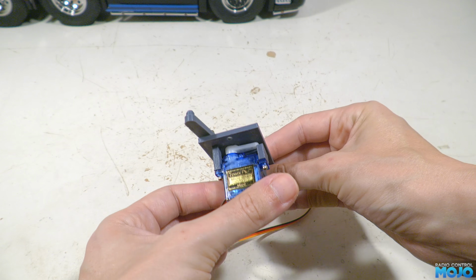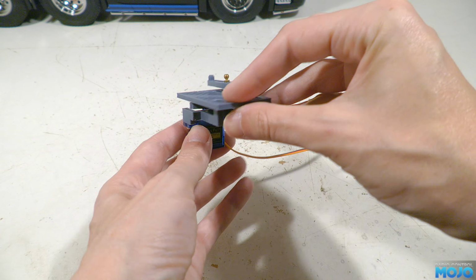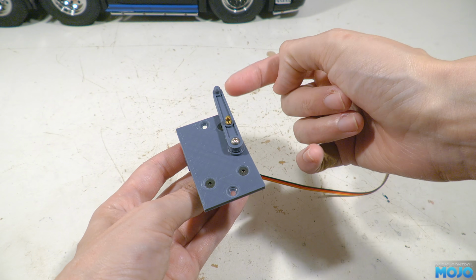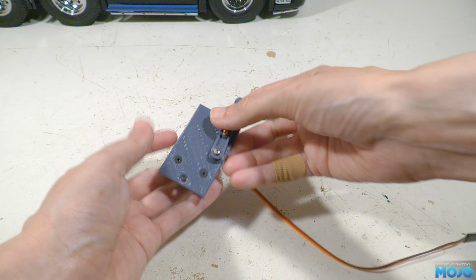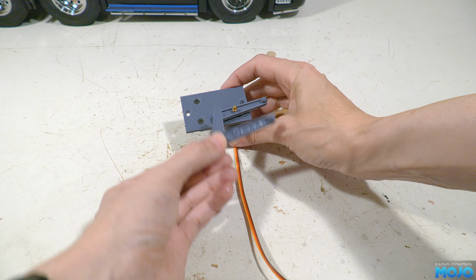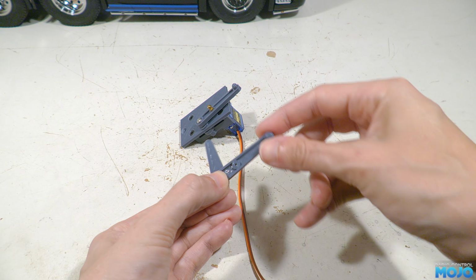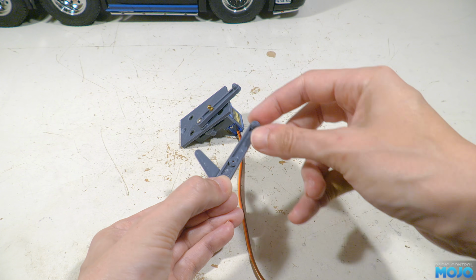There aren't any special linkage parts. In fact, other than a few screws and the servo, everything can be 3D printed. It works by having the servo arm push against a follower that's attached to the lever. The lever and follower are free to move away from the servo arm, but when the servo arm moves, it pushes the follower round, moving the lever.